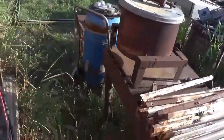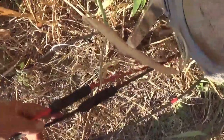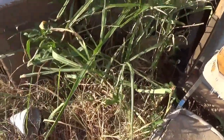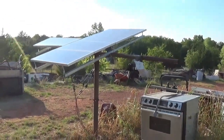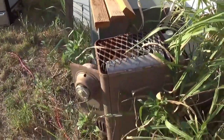I'll show you what I did here on the outside too. Everything's just kind of temporary — got the wires laying on the ground. I bought a few of these half-inch fittings to run the wire in. Another thing I did a little different: on that original set I had 20-foot hot and power coming in with plugs right here, then another 20 foot of cable going into the charge controller. So I thought, why don't I find 40 foot of 10-gauge cable that'll plug in up by the panels and run all the way into the charge controllers — a little cheaper and one less connection.